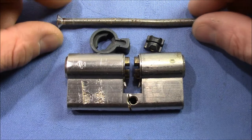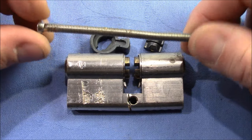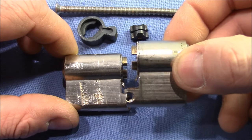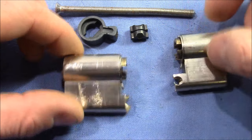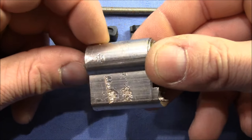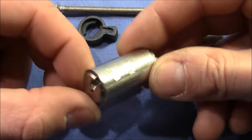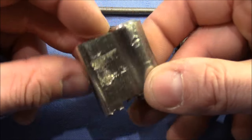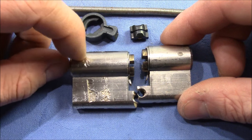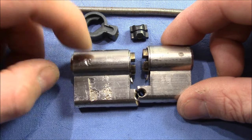Back in the warm lock lab, here you can see all the parts. The screw has been deformed a little bit from my snapping attack. That's the cam and the actuator. This is the outside part, and here is the inside part that stood outside from the flat surface of the door so I could grab it with my little vise and bend it — you can see the marks here. It's really easy to snap these locks if the Euro lock stands more than three millimeters outside from the flat surface of the door.